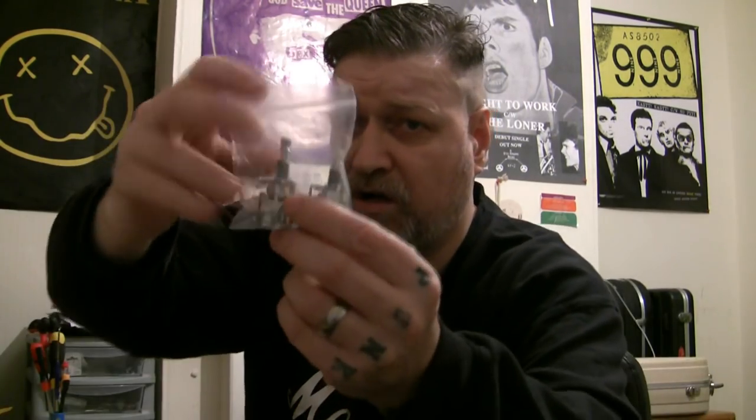I'm going to split the coils. I have in front of me a huge array of pots, and these are push pots, 500k alpha pots. I'm going to stick one of them in. I also have a bag full of 300k pots there. I do have one specifically for a Telecaster, which is that one, so that is going to be the volume. I also have other pots knocking about, various custom ones. I've got bags full of them, proper Fender CTS ones, all there.